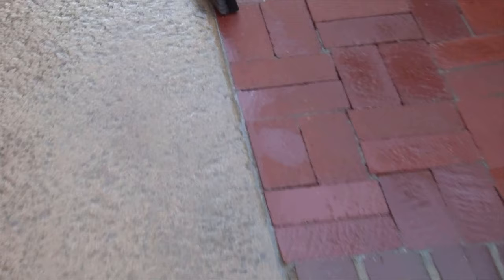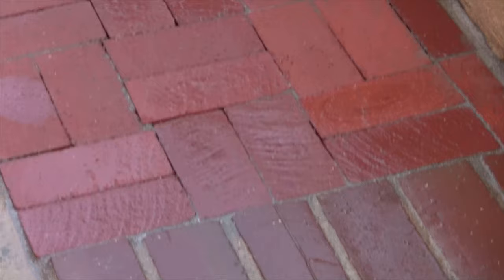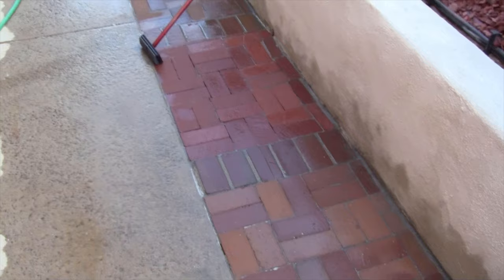With this technique you do lose some granules or mortar that I put down — you can see a hole right there. But if you look at the rest of that joint, pretty much the whole joint other than that one spot is still intact. So 95 to 98% of the mortar I put in is still existing. Smaller joints got washed out in this process, and that's why I'm still going to need to use the polymeric sand. But the larger joints still have the mortar left in them, so I'm still locked in on 95% of the project. We'll just let this dry out tomorrow and see how well I did on the hazing.